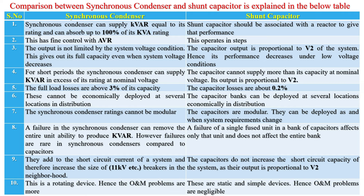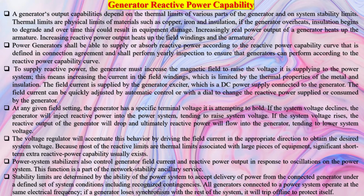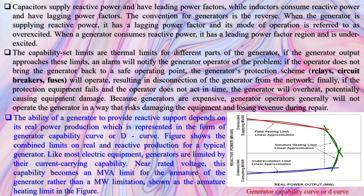In terms of support during disturbances, Synchronous Condensers can support the stabilization of the power grid. They increase both the short-circuit resilience of the grid and the inertia of the system, and supply reactive power with a significant delta increase over the rated value. As more intermittent renewable energy sources enter the grid causing fluctuations, synchronous condensers represent a fully reliable and proven solution to address the stability requirements of the grid.